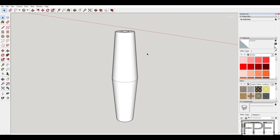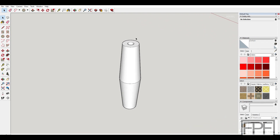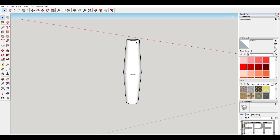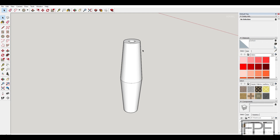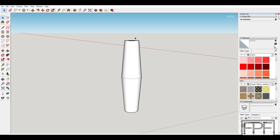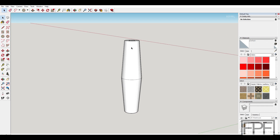This is quite a tall piece and if it was PLA or PETG I think we'd be okay, but I am a little bit worried about this in TPU. Even with the larger contact patch — I did thicken up these ends and squat this guy down a little bit — this is still going to stand quite tall into at least the upper one third of this print. I'm a little worried that if it flexes at all in the lower portion, even with a brim, we could end up with some shifted layers up at the top just with the acceleration of the bed going back and forth. If this guy shifts and we have minor layer shifts up here, it's going to significantly weaken it.